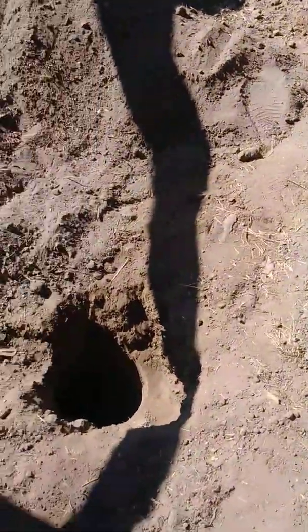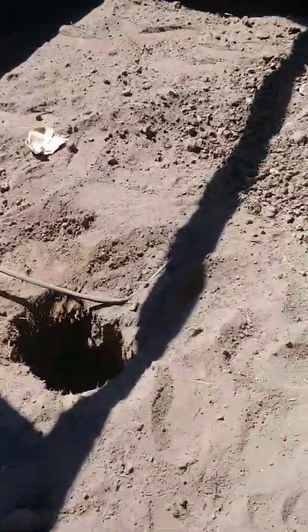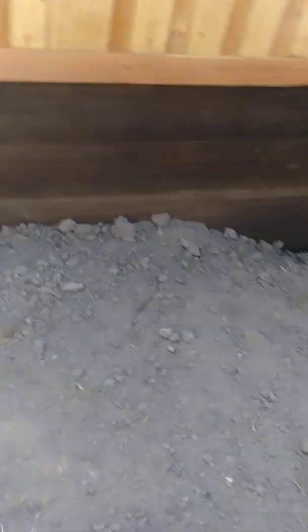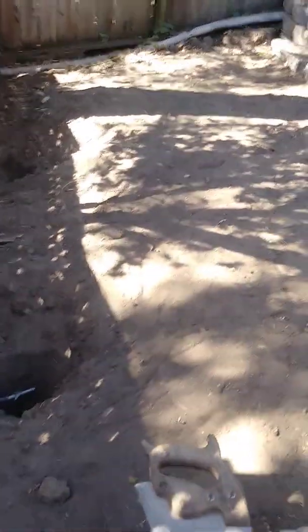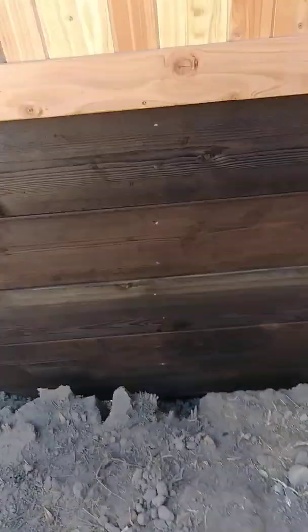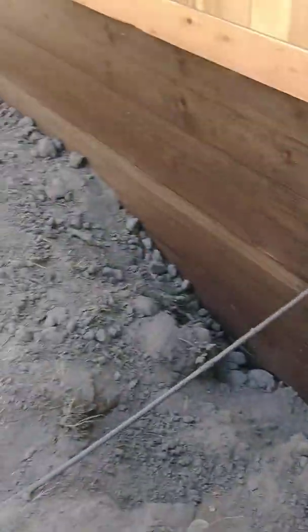You can see the holes I've got dug on each of the post locations — these are two to three feet deep. The all-thread is set back four feet from the post, bent 90 degrees with a one-foot bend on it. I'll fill these holes with concrete and embed the all-thread, and this will serve as a dead man for each of the posts. On each of the all-thread rods, I've placed a regular bicycle inner tube — just cut it and slide it on — and that will act as a wrap so the elements don't corrode it over time. We'll fill the hole with concrete, backfill, cover it, and never see it again.